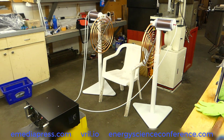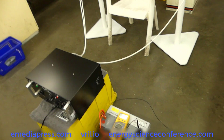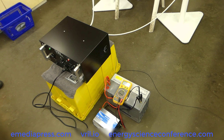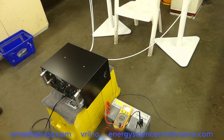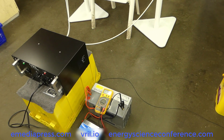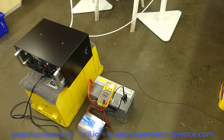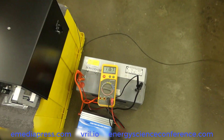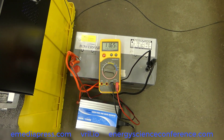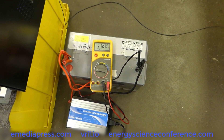We got it, and obviously we're able to get full power — no problem. This is the easy solution for anybody overseas, anybody who wants to take this camping and set it up at a barter fair, or who just wants to be completely electrically isolated from their home power supply. This is the way to do it. It's not drawing very much, and again this is a deep cycle battery — good all the way down to 10.5 volts, and it's at 11.6 right now, so we're just going to run that for a little bit.